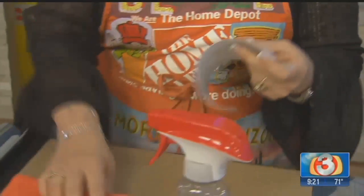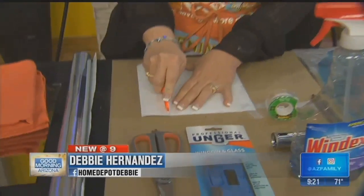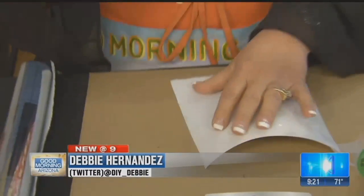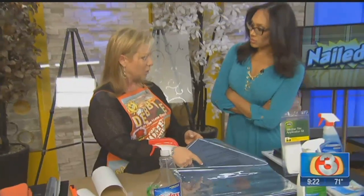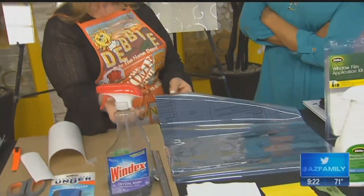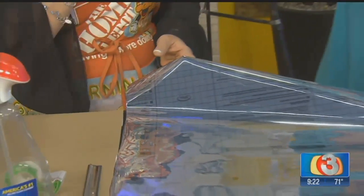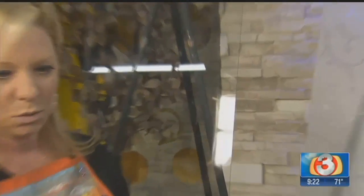Such a great hacker tip! For cutting, just use a regular utility knife with a cutting board or surface underneath — it cuts very simply. This heat control tint has a grid liner on it, which you can see, and that helps you make straight cuts. Use a straight edge to cut it. One side has a factory edge that comes off the roll — use that factory edge on every window, then cut the other three sides about an inch over so you can trim it in place.